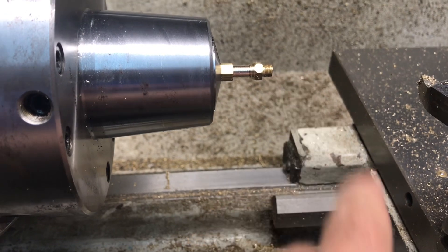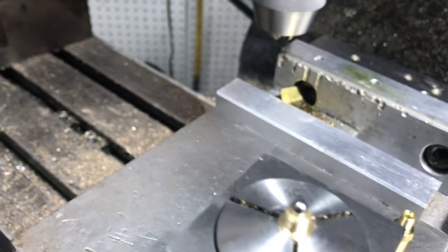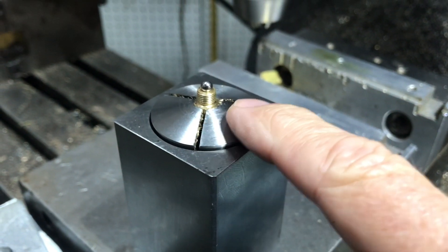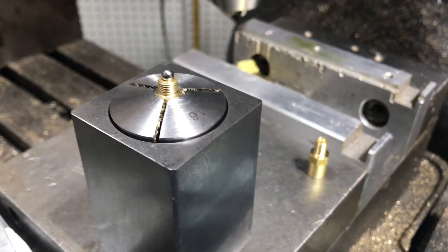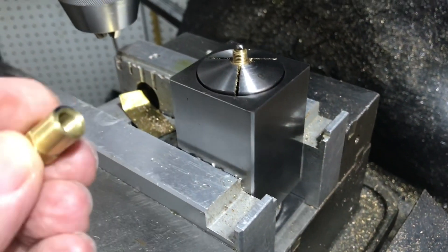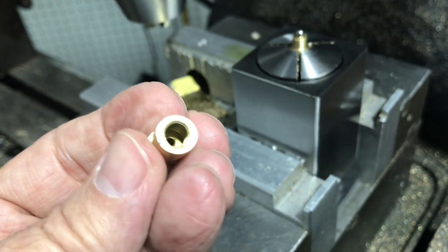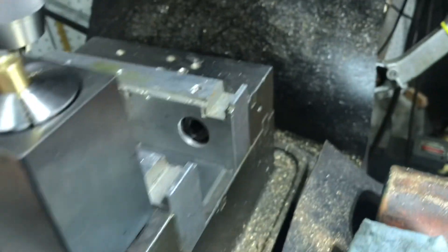Next thing to do for the base of the snifter is to put a stainless steel ball in there and smack it just to make a seat. Since that's a two-handed operation, I'm going to stop videoing at this point. But I did want to show my setup — I used the part in the 5C collet block and usually I put the block in the vise just to hold it extra steady and just give it a nice wrap with a ball peen hammer. Now that that's done, I just give it a nice tap with a ball peen hammer. Obviously you use the flat part of the ball peen, not the rounded part.